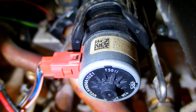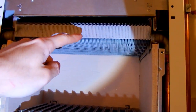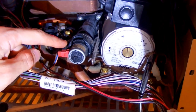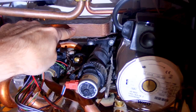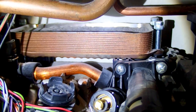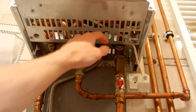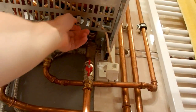This is probably the motor of the electric water valve. It seems like there is a closed circuit where water circulates through the primary heat exchanger where it gets heated, and then it can go either into the heating elements in the apartment, or into a secondary plate heat exchanger where the tap water is heated. The electric valve is probably switching between those two circuits. The plate exchanger has many plates — heating water flows through the odd ones and tap water through the even ones, transferring heat to the tap water. At the bottom there is a valve used only initially to fill the circulation system from the tap water, after which it is closed.